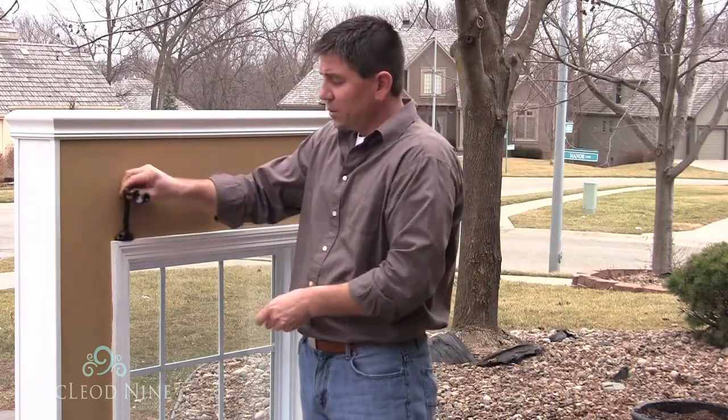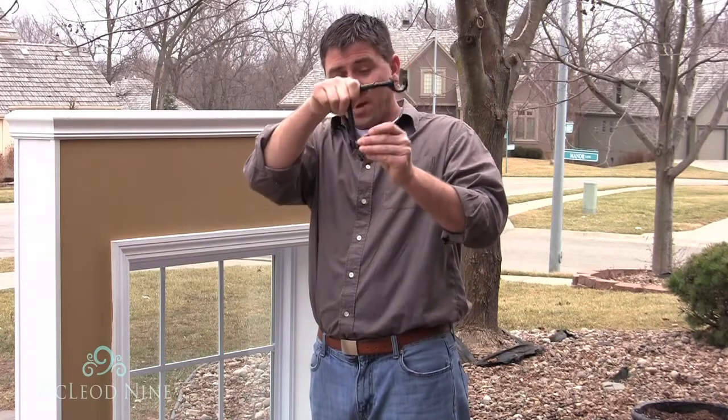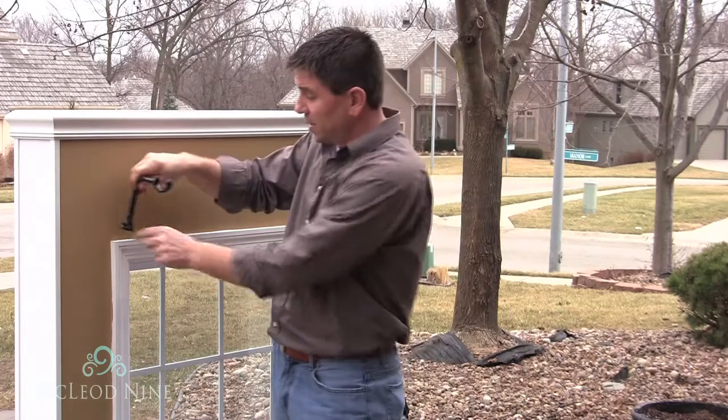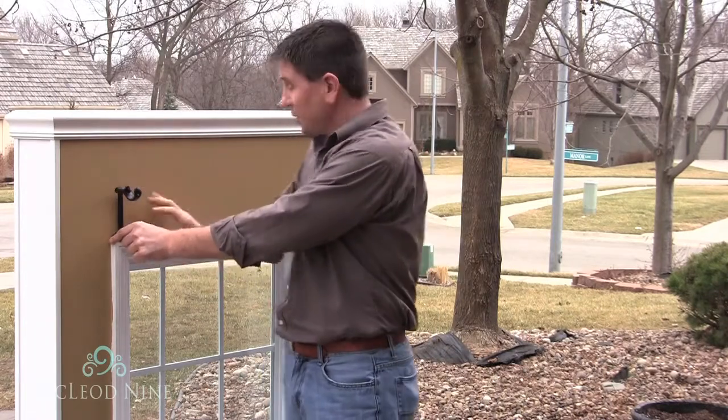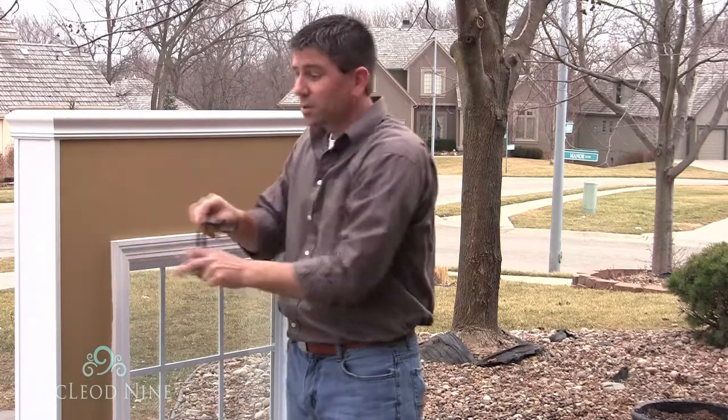When it's installed into an inside corner, its biggest strength is that your house, when it was built, has all the internal framework and structure that it needs to hit a stud every single time when you use the piloted holes on the bracket to feed the screw at a 45 degree angle. You're guaranteed to hit a stud. Either the window header, the window framework, the wall studs in the corners, the wall studs in the ceiling. You're going to hit a stud every time.